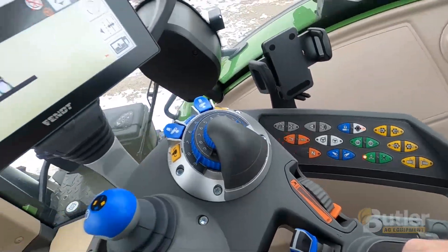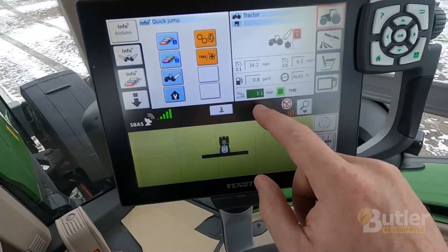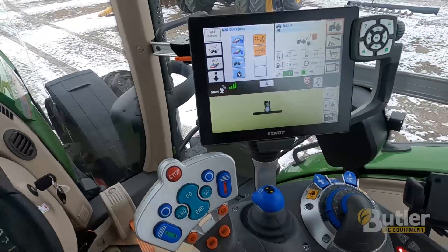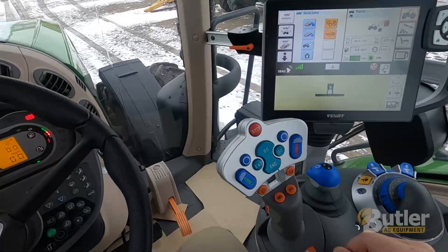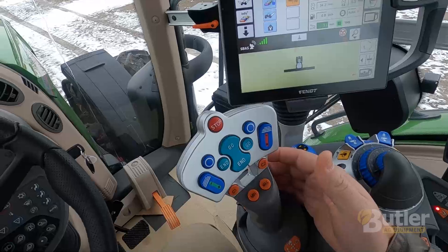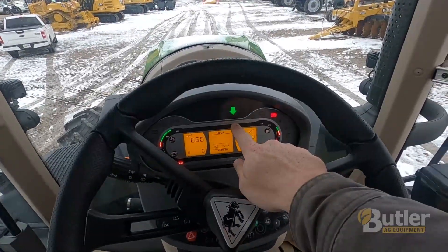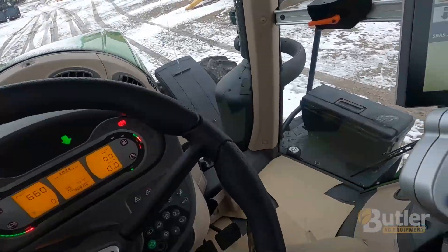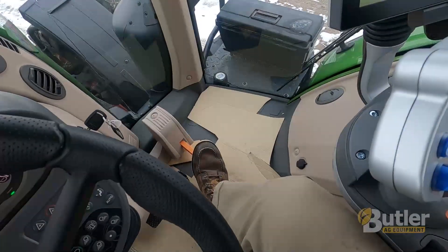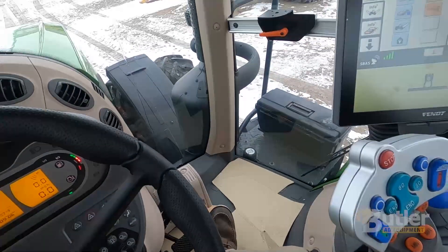So I'm at 3.1 maximum pedal speed. To work the pedal now, I'm going to pull the trigger and pull backwards — that'll show me I'm in reverse, indicated by the blinking green light. Now when I push on the pedal I'll go slowly backwards, and this allows me to really fine-tune my movement when I'm hooking up an implement.